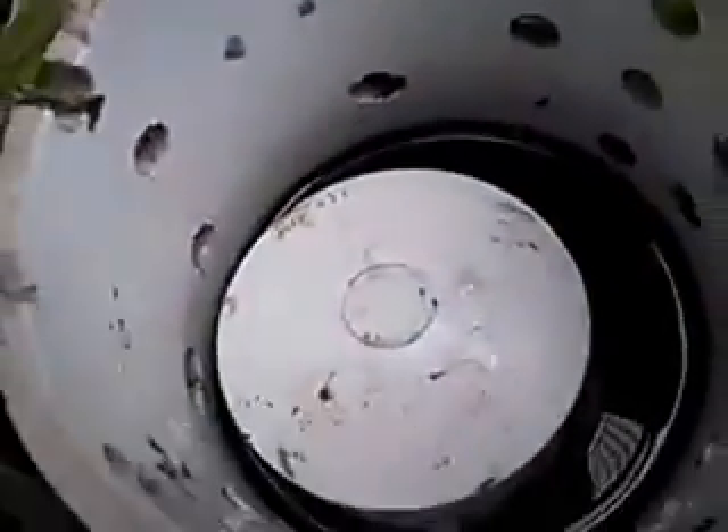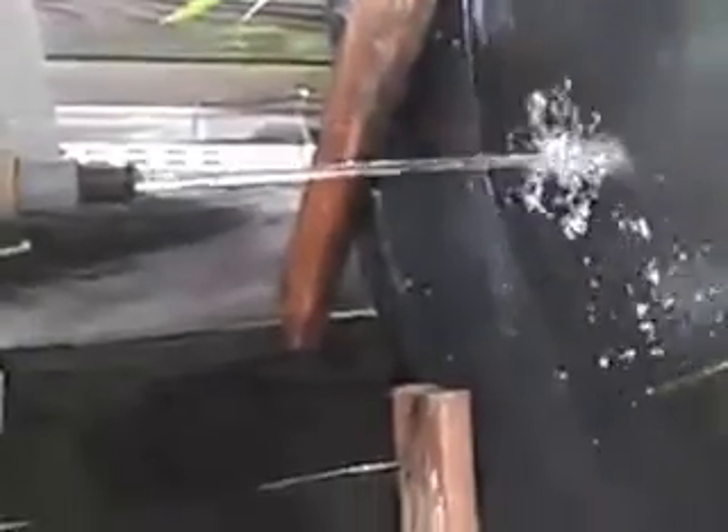So we're looking for the stop here. It's kind of hard to tell — my little indicator on the side doesn't really show very well. But we can look in here and see the water level going down. It's not quite going down so much right now; we should have a better flow out than that. Let me check my restrictor there. Just me touching it made it start — I'm a little concerned that maybe it's not starting properly either, so that might be something to look at as well.